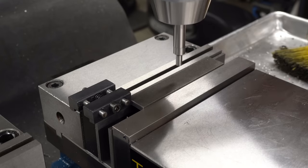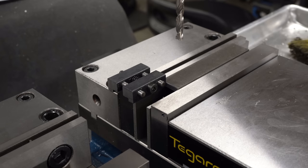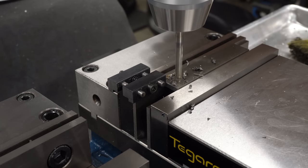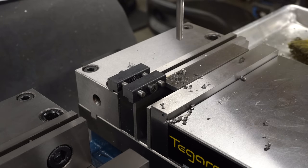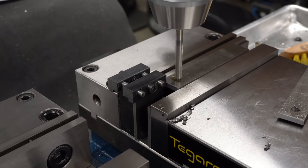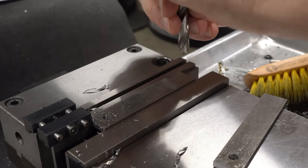I'll drive to zero zero on the DRO and make sure it visually looks like the center as a sanity check. We'll hang the drawing up on the back of the mill with a magnet and get out some drills. There's a quarter inch pin in one end and a larger hole in the other for the nut, so I'll start by drilling one size under quarter inch, then come back with a reamer for an exact fit on the pin. We've got two of these parts, so I'll swap them out with a stop to reduce setup.